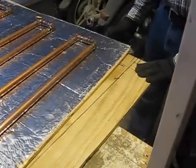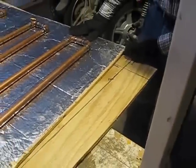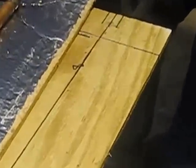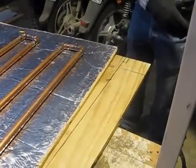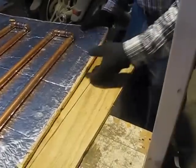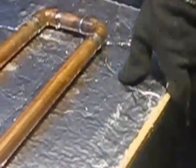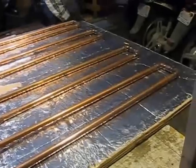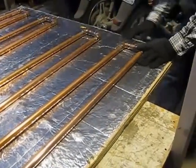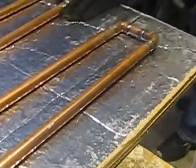We've got our three-quarter plywood full base sheet down. Then we lay our R-Max insulation on top of it. Make sure you've got your marks down where the copper tubing is in the proper place. The flow tube has got to have an upward slope. Line up your insulation on your plywood, and when it's covered properly, come back and make sure the flow tubes are in the proper position.